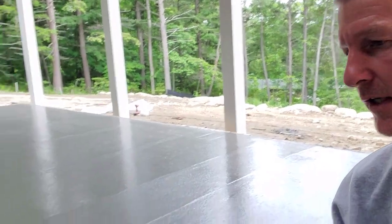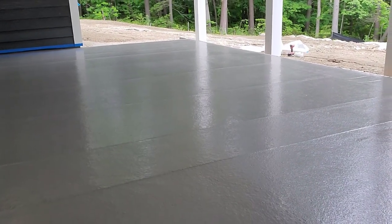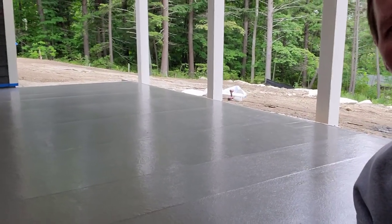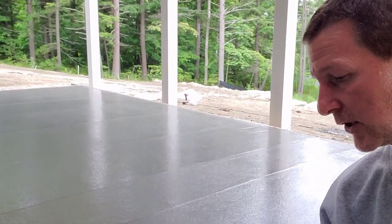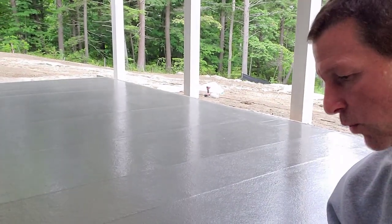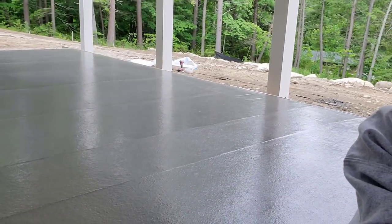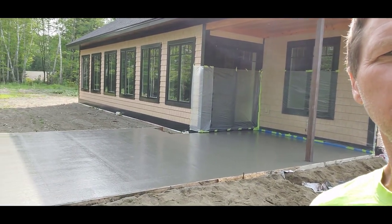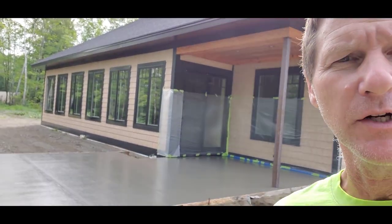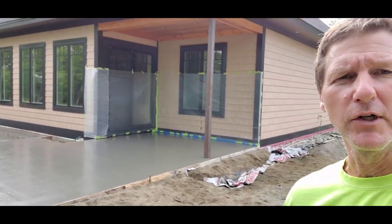Come back. It's kind of cloudy today, about 70 degrees out. We're using 4,000 PSI concrete today with fiber mesh in it, and we're going to be cutting some grooves and edging the board. We can't wait too long — we don't want the concrete to get too hard, but we have to wait for the right firmness before we start. So we got this patio we're gonna stamp, and today we're gonna talk about when to start stamping, which is usually one of the most difficult things to learn.